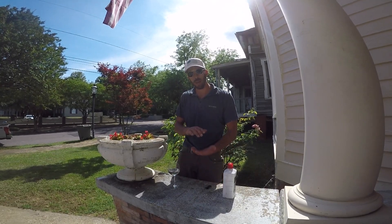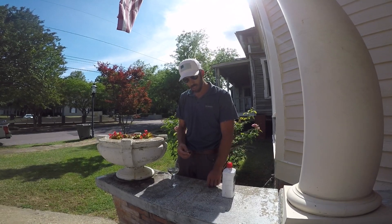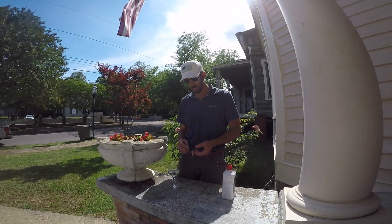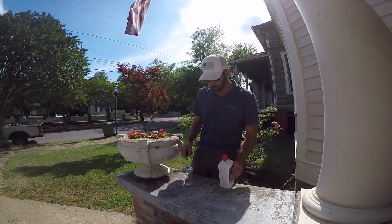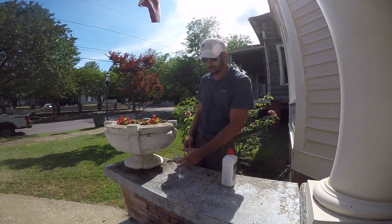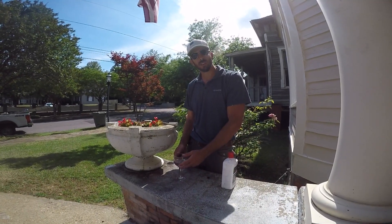It has a top layer of gravel, and I've got some pieces. I did a core test the other day, and what you do to test if it's coal tar pitch is you put it inside lighter fluid — that's lighter fluid I poured into this glass right here. If it turns a yellowish-green color, then it's coal tar pitch. If it turns brown, then it's asphalt.